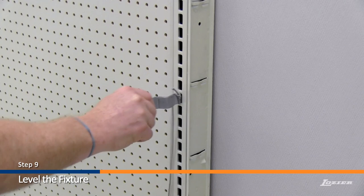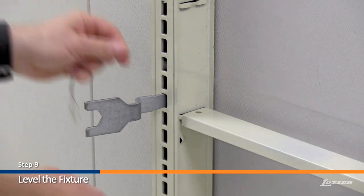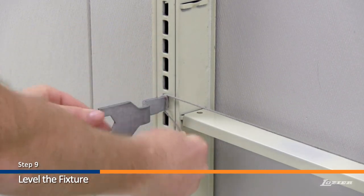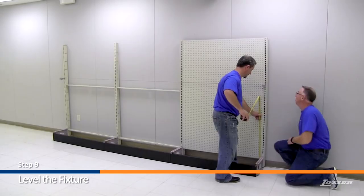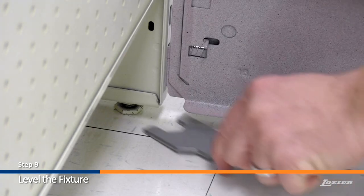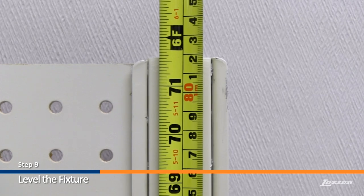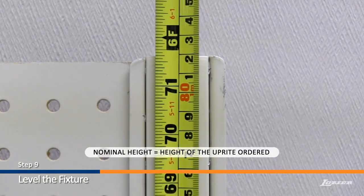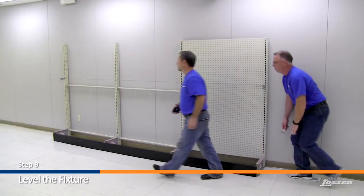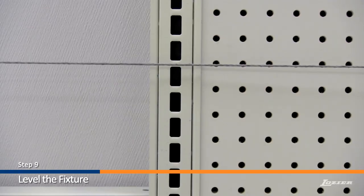Step 9: Leveling the fixture. Insert a leveling leg wrench into the two end upright slots, making sure that you use the same slot on both uprights. Run a string between the two leveling leg wrenches, pull tight, and tie. Next, measure the end upright from the floor to the top. Using the leveling leg wrench, adjust the upright leveling leg so that the top of the upright is three-eighths of an inch under the upright's nominal height. The nominal height of the upright is the height of the upright that was ordered. Repeat this procedure to the upright on the other end of the run.